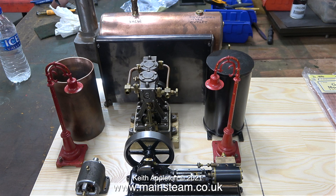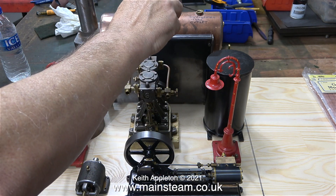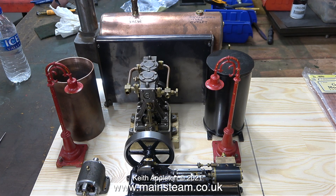I have the final layout and I hope the customer is watching this video. It is most important to think about the pipe runs before you start the piping. The outlet is at the right-hand side of the boiler where it says superheated tube outlet. I'm going to make a steam turret that fits on top of the boiler — this will feed steam to both engines with a spare outlet for running a steam engine not in the plant. By making sure all the steam connections are at the same end of the plant, the right-hand side, all of the steam piping will be as short as it can be, and by cladding the piping in string as usual it will keep the steam hot. I've also turned round the S50 — this is an obvious thing I completely missed when I first set the layout. I quite like the symmetry of this and it really does make a lot of sense. I'll change the position of the exhaust outlet on the Double 10, which will move it closer to the condenser. I've seen quite a lot of model steam plants completely ruined by terrible piping, and I'm going to make sure that the piping on this one is as neat as possible.